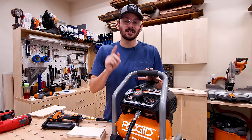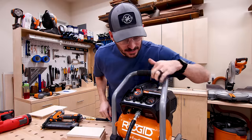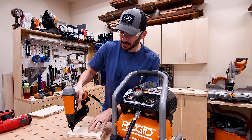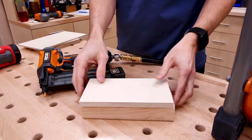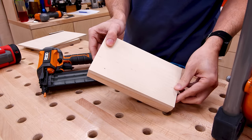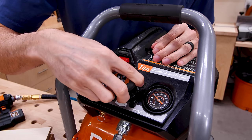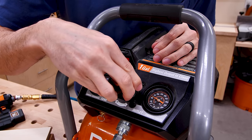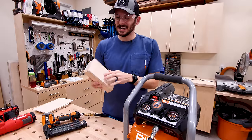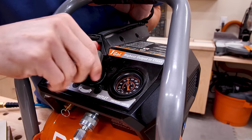The number you're looking for is on the outlet side, not the tank side — the outlet side will always be smaller. Mine right now is set at about 70 PSI, so I'm going to nail this in and we'll see how deep it goes. At 70 PSI the nail is just barely under the surface — I almost can't even fill that hole because it's basically flush. I'm going to crank it down to 50 just to show what it looks like if it's under-firing. At 50 PSI it definitely under-drove and the nail is proud of the surface.